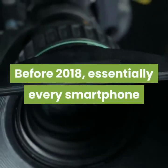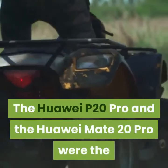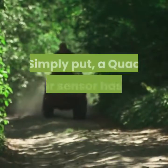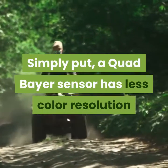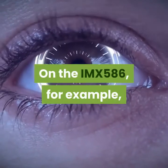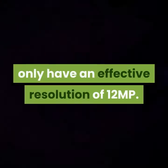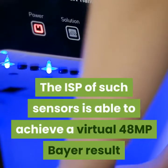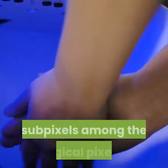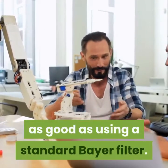Before 2018, essentially every smartphone camera had a Bayer color filter array. The Huawei P20 Pro and the Huawei Mate 20 Pro were the first phones to use quad-Bayer sensors. Simply put, a quad-Bayer sensor has less color resolution than a sensor with a standard Bayer layout. On the IMX586, for example, the physical color filters on the camera sensor only have an effective resolution of 12MP. The ISP of such sensors is able to achieve a virtual 48MP Bayer result out of the sensor by rearranging the subpixels among the logical pixels.